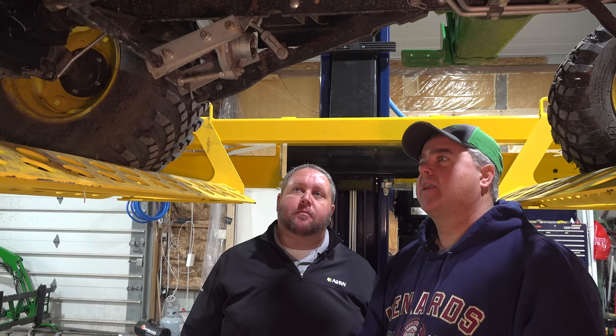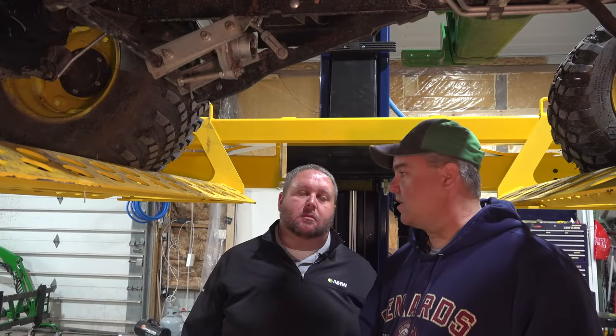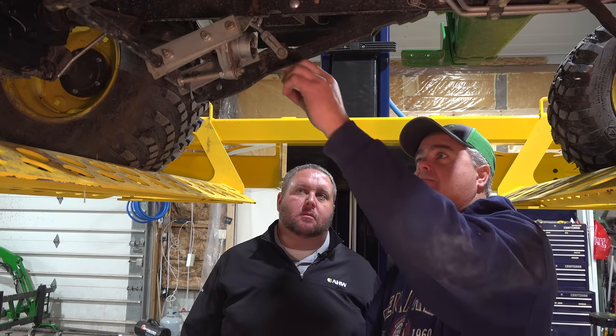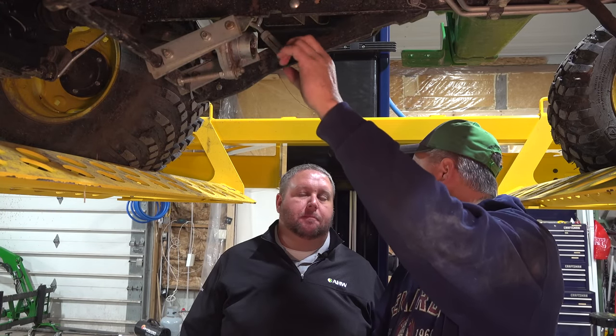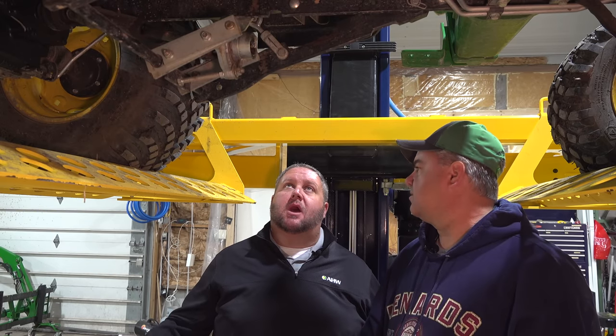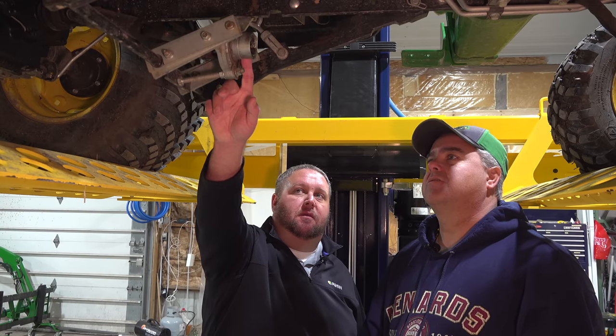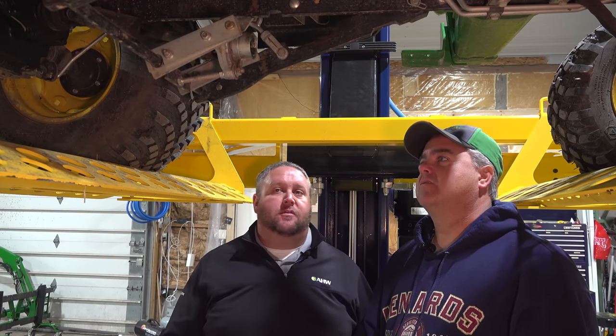Yeah, I mean, you're right. I put grease in mine, and I'm not sure I'm recommending that. I felt like it wasn't sliding on nice enough, so I put grease on it. But I'm afraid that over time, when this is unhooked, it's going to get grimy and actually drier. As many jobs that you do with this tractor without the mower deck on it, I think you're going to see that this with grease in it is going to fill with debris.